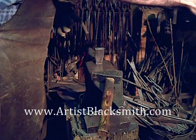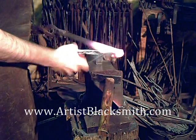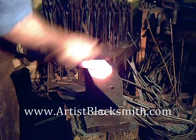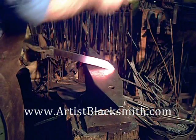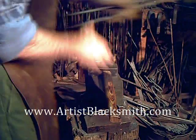The gas forge is just outside the picture frame, but you can see I'm pulling it out. It comes out at a bright yellow. I'm using pliers to break the cut on the tip. The actual edge is on the long side — most people think the edge develops on the top side, but that's not true. It's on the bottom side, closest to the anvil right now.